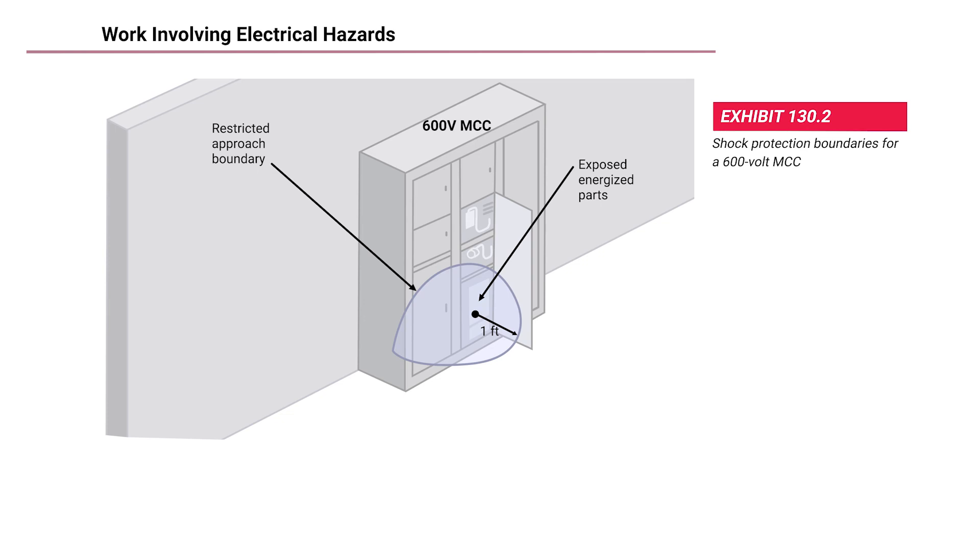If you don't have any other means of measuring it and your electrician is amenable to opening the cabinet, you will have an opportunity to see what is inside the enclosure. With a thermal imaging gun or some kind of thermal device, you can take the temperatures inside the cabinet and make an accurate reading of what's happening inside.